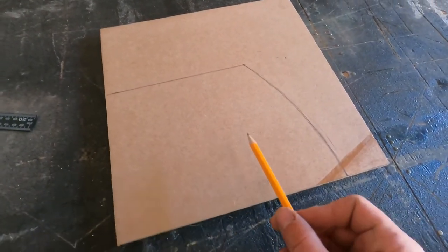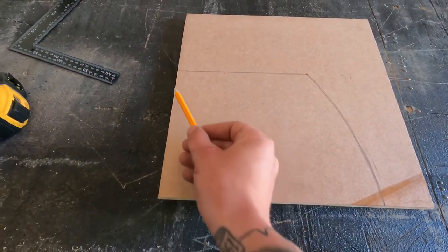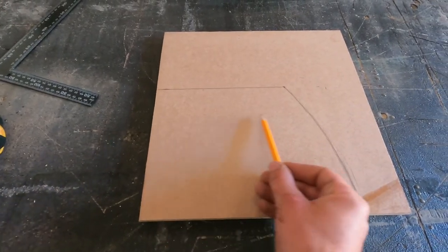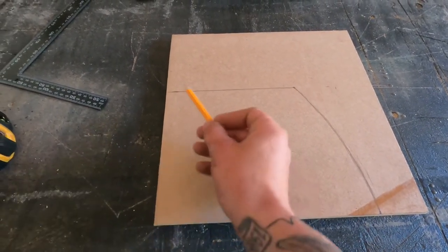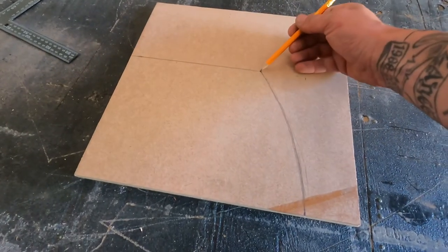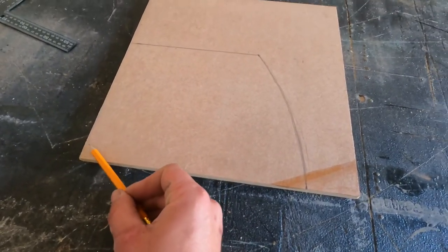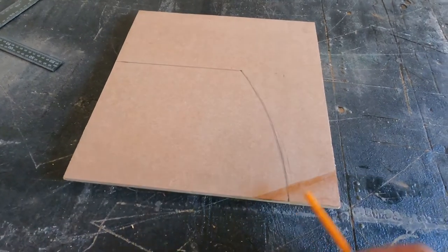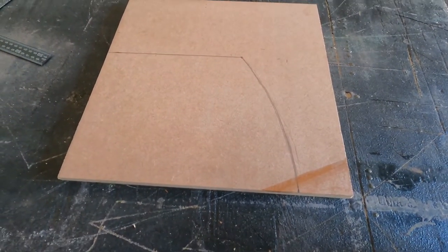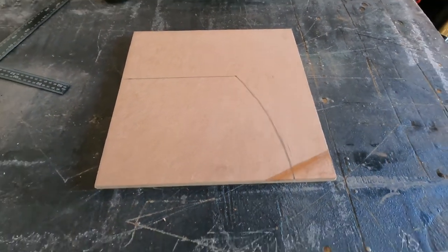There is another way to do this more accurately first time: measure down in increments of 20mm, mark your batten on the inside, then measure across to the wall repeatedly at each increment, and transfer those measurements joining the lines like a big dot-to-dot. But I've just measured in to where the point of the roof starts curving and given it a really good curve. This is our 265mm measurement - so this is the front corner, top corner where the roof starts to curve, and the bottom corner. I've given it a nice wide curve, so I'm going to cut that out. If it fits, it fits. If it doesn't, we'll trim it down until it fits perfectly, then use it as a template for the other three end panels.